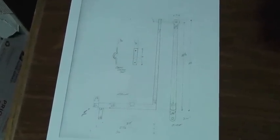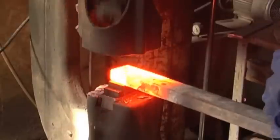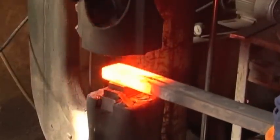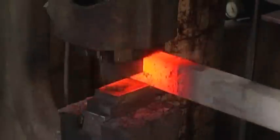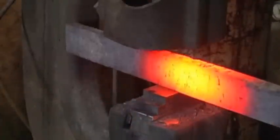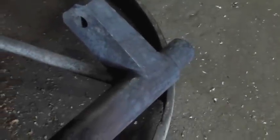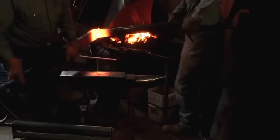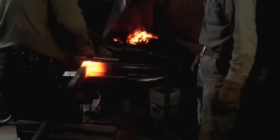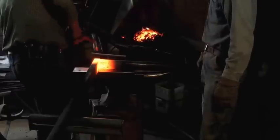The brake handle itself was made out of inch and a half thick by three inch wide steel. Where the brake handle attaches to the two and three quarter inch brake bar was fine, but it needed to be tapered down to an inch thick on the end. Working in the forge, we can only heat about six to eight inches at a time, so this is piece by piece tapering until we finally have the brake handle. The bar that activates the brake beam is welded onto the two and three quarter inch piece — turned to receive the brake handle, then stuck in the forge and welded into place — finishing with cleaning up and stress relieving.